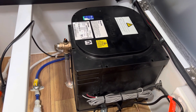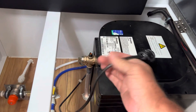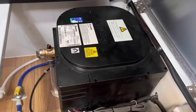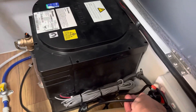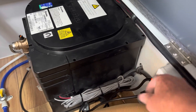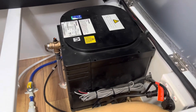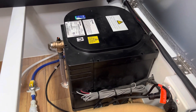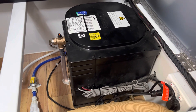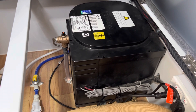If we're going to run it on 240 volt, the first thing we need to do is look for our 240 volt power line, plug it into an outlet, and if you're camped at a caravan park or plugged into 240 volt, you can turn the switch on and that's all you have to do. Within half an hour to 45 minutes you'll have hot water — though we find we have hot water probably within about 10 to 15 minutes.